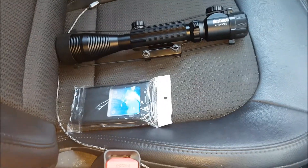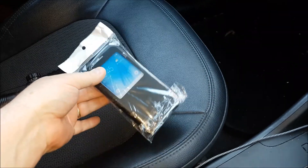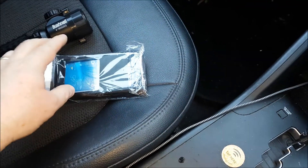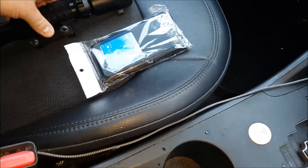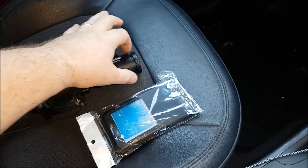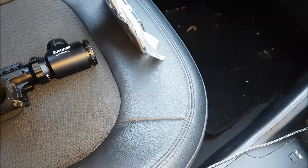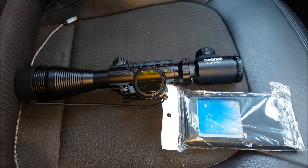So what we need to start with for this scope cam is a phone case to suit your particular phone. It doesn't have to be anything special — this is just a cheapy one I got off eBay for a couple of bucks. You want one that will hold your phone but still has a little bit of flex to it, though it needs to be reasonably rigid because we've got to screw a PVC cap onto it. We've got the scope here so we can measure it up, because we need a piece of tubing that will fit neatly over this section of the scope and hose clamp down onto it. Then we need a matching end cap to screw onto it so it attaches to the end of the scope and your camera slots into it.